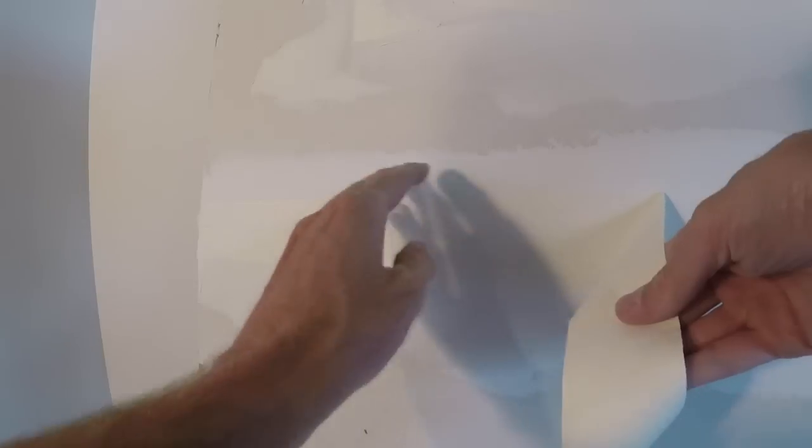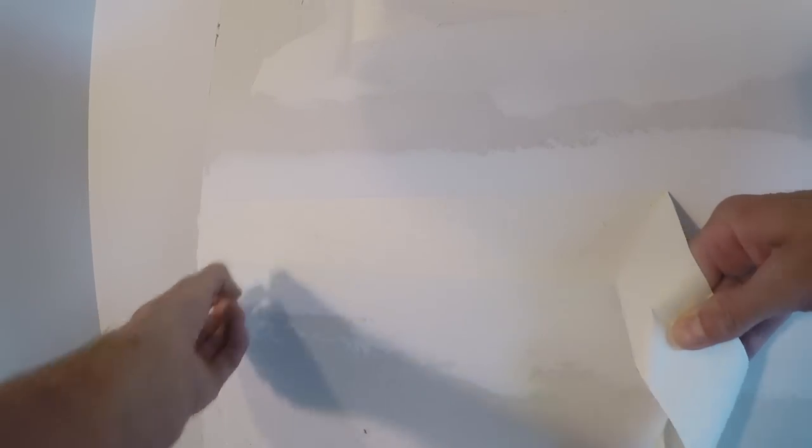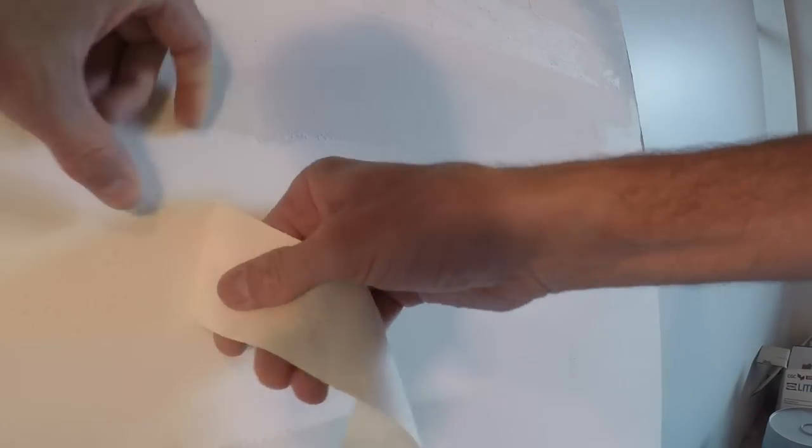That's really good. What you can see is it's actually pulling the tape right in half — I can't get all this stuff off. This definitely works well. Heavyweight all-purpose for the win: it completely ripped the tape in half lengthways. Comparing all four: heavyweight all-purpose wins, then all-purpose light without wet tape, then heavyweight all-purpose with water, then all-purpose light with water. Maybe don't do that homeowner wet-tape trick anymore — the bond is not as good as you think.